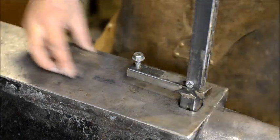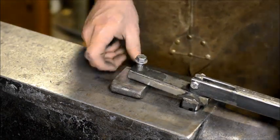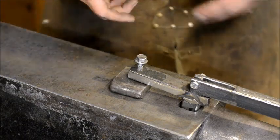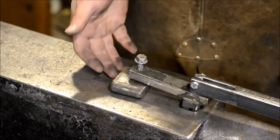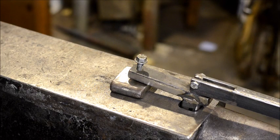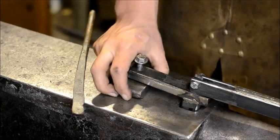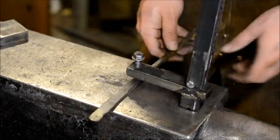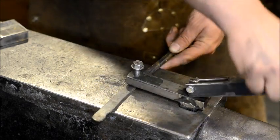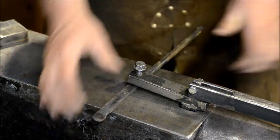What I've designed to get around that is a tool with a thumb adjustment for extra tension. It's as easy as this: you swing your lever down and it locks into the anvil just like a big vice grip. The advantages are that this height is adjustable all the way down to quarter inch or three eighths inch material. This is roughly about an eighth of an inch, and right here's three quarter inches thick — and I can't pull that out of the anvil. Give our handle just a little bit of a crank down, adjust the fine tuning knob, and boom — we've got that secured.